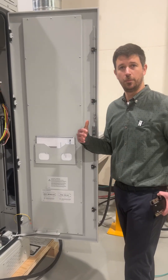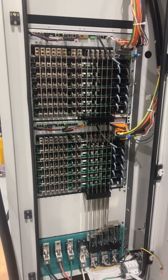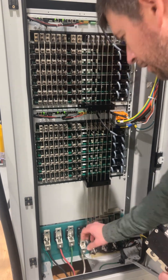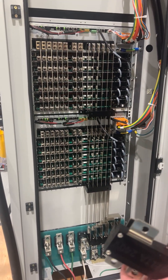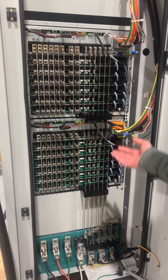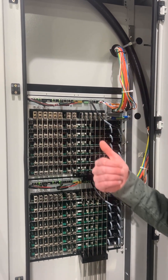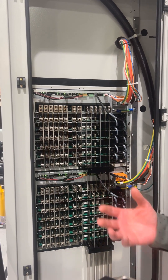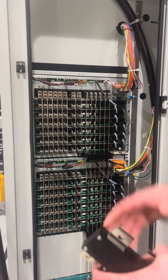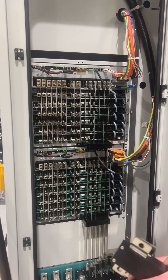On this side of the cabinet, I'm going to show you the back side of those same rectifiers. In terms of our cabinet on the power distribution side, we essentially have our AC power coming in here, going through that main switch on the other side that Dan showed you, coming into our configuration bus bar, sending the power up into our paralleled power packs, going through the rack controller — measuring all the incoming power — and sending that power to each one of our power shelves.